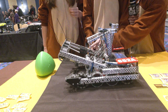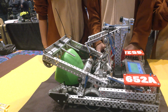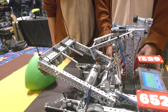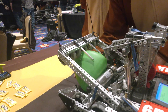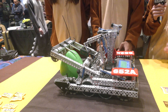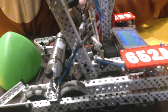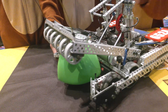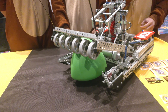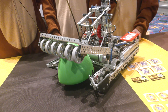The main next part of our bot is our intake. We have a one-motor intake with a 1:1 gear ratio. Our intake uses flex wheels. In previous iterations we tried rubber bands and flaps — rubber bands were a bit slow to intake and got tangled with other robots, and flaps intook well but were hard to retain the tri-ball. Flex wheels are kind of a balance between intaking and retaining the tri-ball. Two other things that help us retain the tri-ball are our intake banding on both sides of the robot and also our string, which lifts the tri-ball off the ground and pushes it into our intake. The banding keeps the intake down to hold the tri-ball. This helps with our game strategy because we like going over the barrier to score — loading one tri-ball into the intake and going over, retaining it while crossing, which makes us really efficient at scoring.